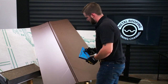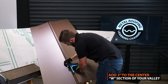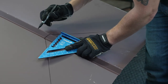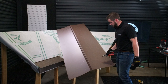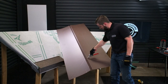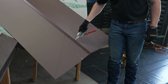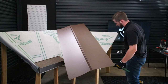Now that we've got that all traced out, I'm going to add two inches to the actual W part of the valley and cut that off somewhat square to start off. Now that we have this all marked out, we're going to start by cutting the actual pan of the valley all the way back to here. You don't want to quite cut into the W of the valley yet. Now we're going to repeat this process on the same side over here, and then we're going to work up the actual W of the valley itself and get that detailed.